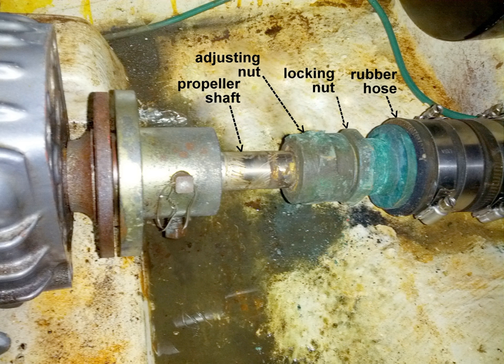The linear seal around the piston rod of a double-acting steam piston is also known as a gland, particularly in marine applications. Likewise, the shaft of a hand pump or wind pump is sealed with a gland where the shaft exits the borehole. Other types of sealed connections without moving parts are also sometimes called glands — for example, a cable gland or fitting that connects a flexible electrical conduit to an enclosure, machine, or bulkhead, facilitating assembly and preventing liquid or gas ingress.